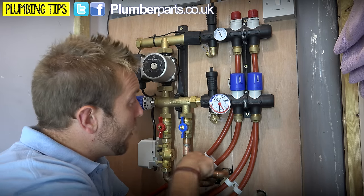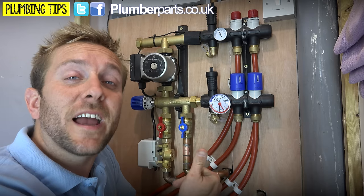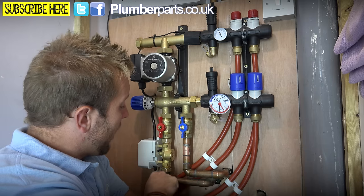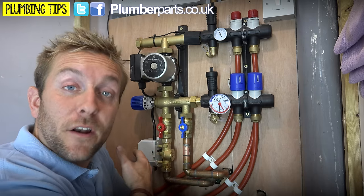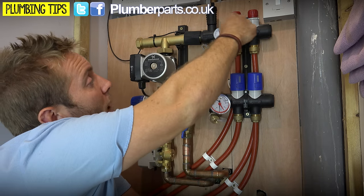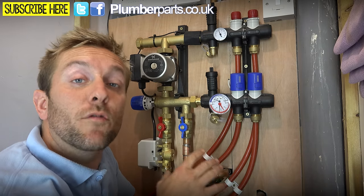Now, as we knew from earlier on, our flow would also go off up to the other services in the system, like the hot water tank and also the radiators that are upstairs in the house. And what happens is the hot water will come here, come through this two-port valve when our thermostat is calling for underfloor heating, and then it will be sucked up through this pump here, and then round and down off to these two flows, okay, that will go off to those loops that are in the floor.